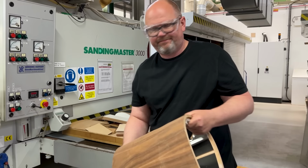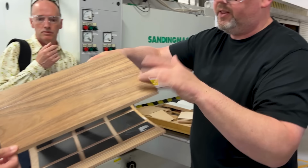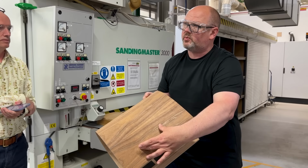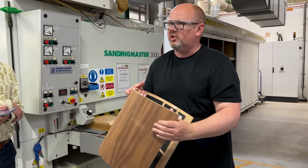Now the bracing system's job, beyond bracing up the structure, is also essentially to compartmentalize the cabinet. If you wouldn't mind just holding that gently there, at the moment this is essentially like a tuning fork, and you can feel the vibrations moving down the structure, traveling down that unbroken length of material. What we're going to do by putting this material inside it is essentially break it up into smaller sections by damping it at key points this way, so that any energy that's in the system only has a certain length along which it can travel before we're controlling it and breaking it up. So the matrix isn't just about pushing against the structure, it's also about compartmentalizing the structure and turning it essentially into smaller sections for us to then damp and control.